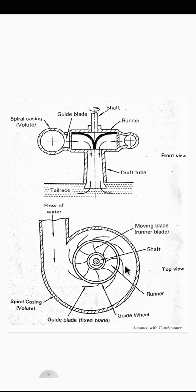The cross-sectional area of the spiral casing gradually decreases along the flow direction in order to distribute the water uniformly around the entire perimeter of the runner. Next is the draft tube, which discharges water from the turbine to the tail race.